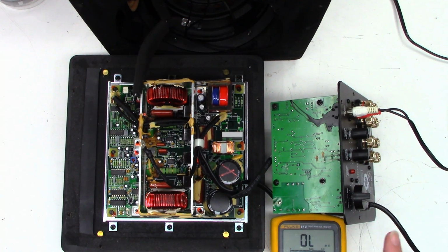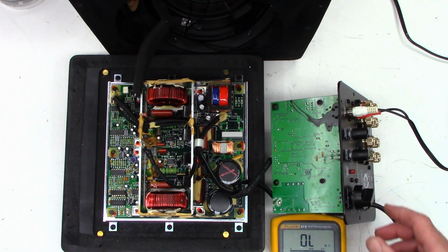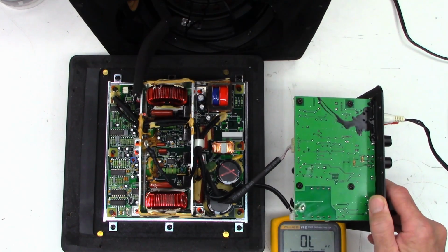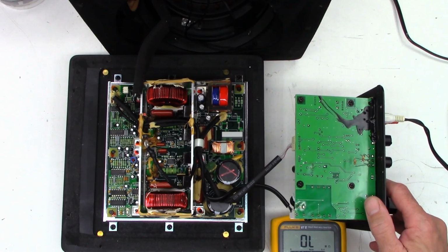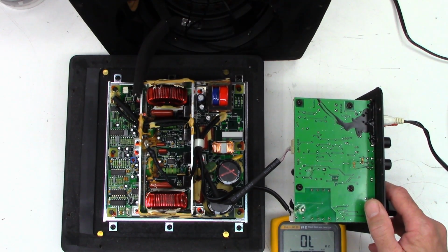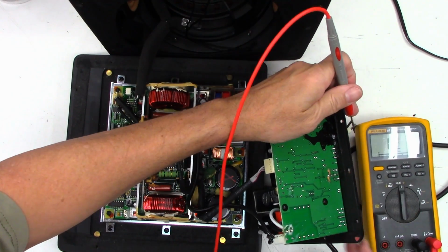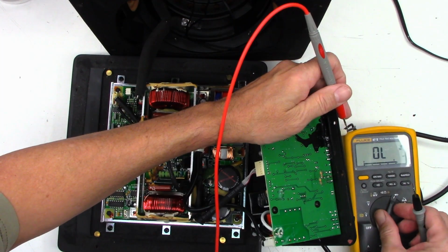You know what? Let me go ahead and add a resistor to the phase alignment, because that might be doing something as well. So the only pot I know for sure is good is the volume control. So I need to scrape this glue that they so considerably added to this board and get to those terminals. One moment. Okay, so I have the glue scraped off here. Hopefully you can still see the meter. Let's reset it so it doesn't time out.